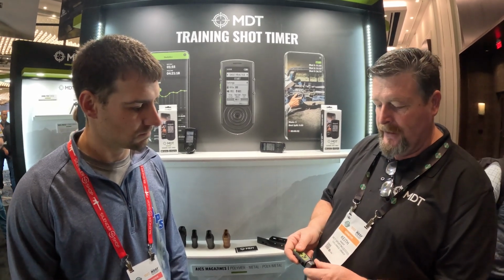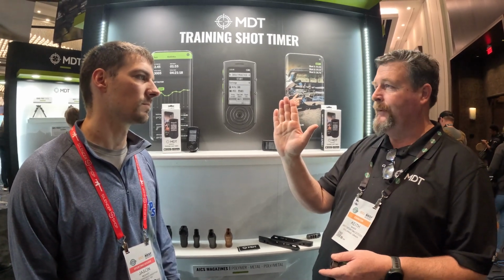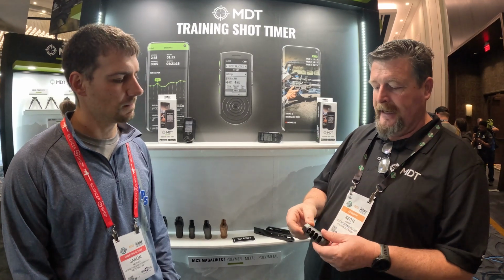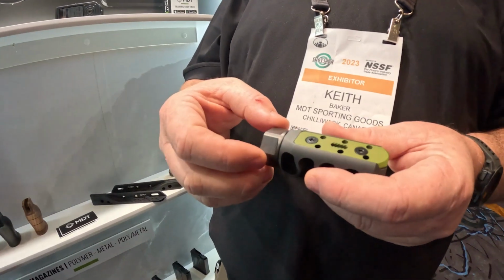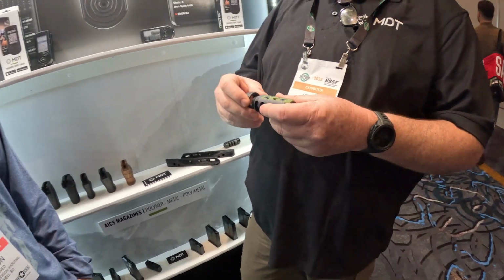And then the coolest feature to it is, with a standard 60-degree thread that locks, they would go through and lock a ring, and basically the thread will clamp on one side or it'll clamp on the other side. So if you come out of a barricade or drop your rifle and your muzzle hits, you can change where that sits on the end of the muzzle. And if you have a little bit of carbon buildup, all of a sudden you could get a strike. Well, we went to the oil and gas industry and found a deep drilling thread. It's square-sided, and that's what we put in the back here. We found that when we lock it in, it locks in square, and as you hit it, you don't get that run out from one side to another, which you would get with a standard thread.